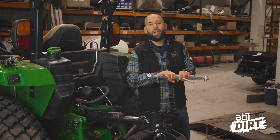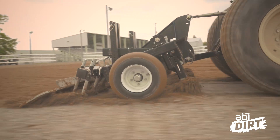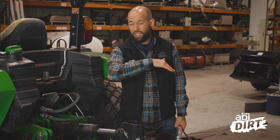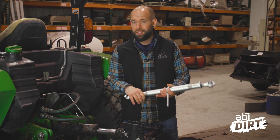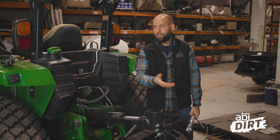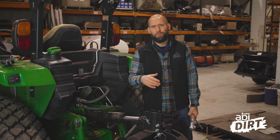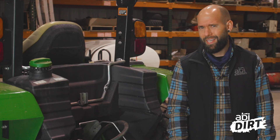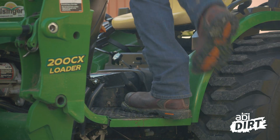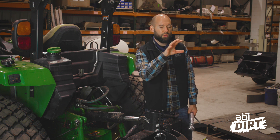That's the value of giving you control, and that's really the game between the hydraulic and the manual top link: how much control do you want from the seat of your tractor? If you're left wondering which is right for you, ask yourself: what attachment do you work with? If it's a one-trick pony set-it-and-forget-it tool, a manual top link may be fine — it's more affordable, easy to throw on, less mess, less worry. But if you like to take real control of the tool and the soil, I'd strongly encourage you to consider a hydraulic top link. Yes, they're more expensive, but remember your time has value. How many times do you get on and off the tractor making little adjustments rather than doing it from the seat? Stay there, hit the button, and really maximize the investment of your attachment.